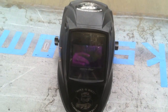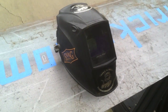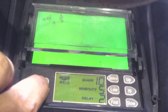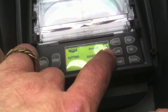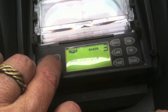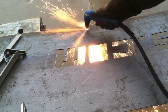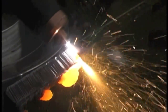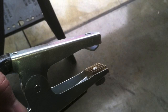So what about eye protection? If you watch gearhead shows like Monster Garage and others, you would think that all you need is a pair of sunglasses to plasma cut in. But that's not good enough for me — I want a little eye protection. This Miller Digital Elite has got different modes: one of them is a cutting mode that lets you go to shade five. You can also go down to shade eight on welding mode or shade three on grinding mode. For me personally, I'll use shade three sometimes if I'm using the drag tip where most of the light is blocked. But if I'm doing heavier work where the arc is exposed, I'll set it on welding mode and use shade eight. You need to follow the safety precautions and recommended shade guidelines.